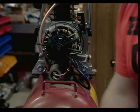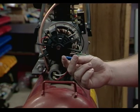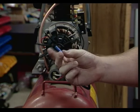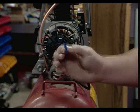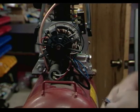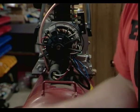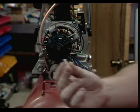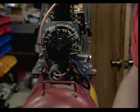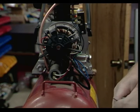Yeah, we're going to connect this with some, I think these may have... No, these aren't from Harbor Freight, but they're just butt connectors. They crimp on. Just one important note, if you've never used something like that, don't try to re-crimp. Like these, they had this type here. And don't try to undo these. Just clip them off. Put new ones on.